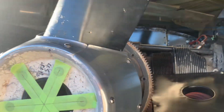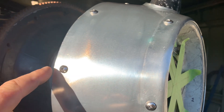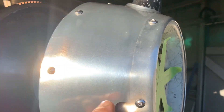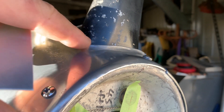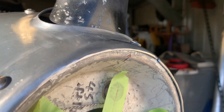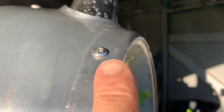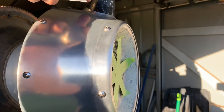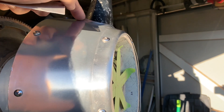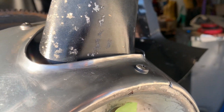There are the two side bits I've made using the paper patterns. Those paper patterns are marked on the inside of the material — because this is fairly thick, if you don't, the holes will be in the wrong spot when you go to curve it and it'll be terrible. Another thing I like to do is flare these edges around the propeller cutout, and even on the front here I flared that down as well — you can sort of see a bit of a curve there. The forward one I wanted flared because when the top part screws on I didn't want a sharp edge chewing into it, and it adds strength. This material is fairly soft, so when it's spinning it actually wants to bulge out a little bit, especially around the cutouts. Putting a little flare in like that stiffens that area up so it doesn't do that. And it looks cool — it's just another part of a challenge.